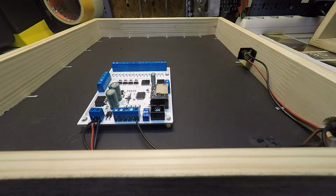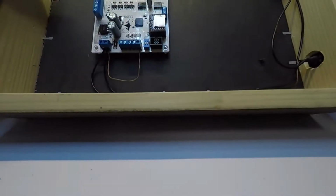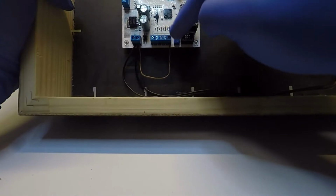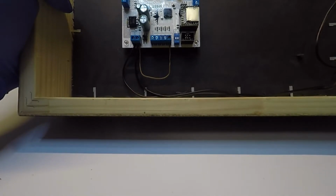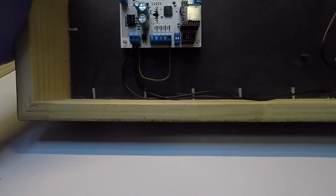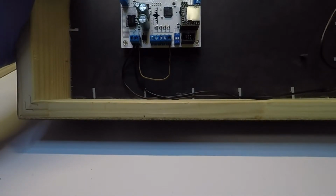Okay, so this is the first way you can connect. The second way is that you use the power supply, go to the switch, and from the switch to the unit, and the ground is directly connected with point 1. And basically, after pressing the switch, the unit starts working indefinitely. In the previous one, the unit is on standby and waiting for the impulse. Here you switch it directly and it starts repeating the effects indefinitely.